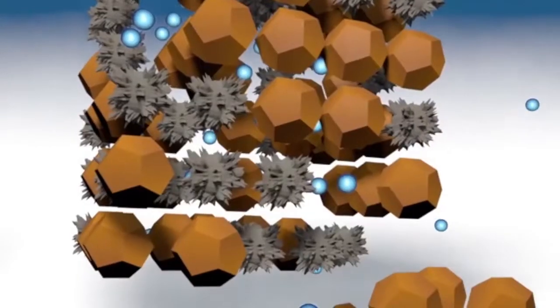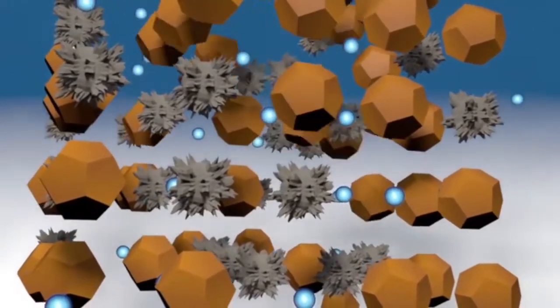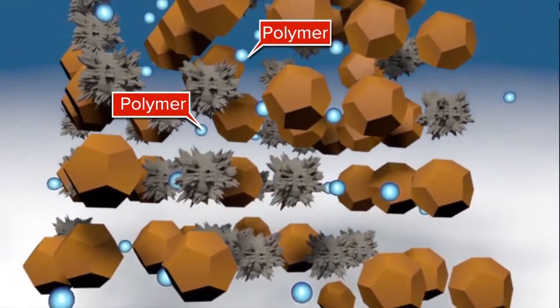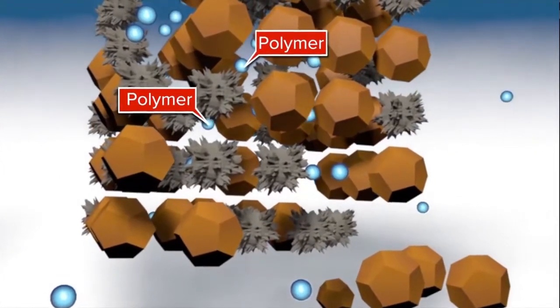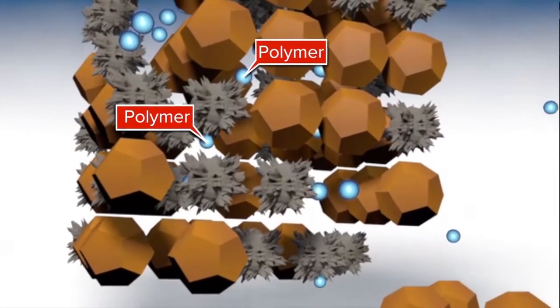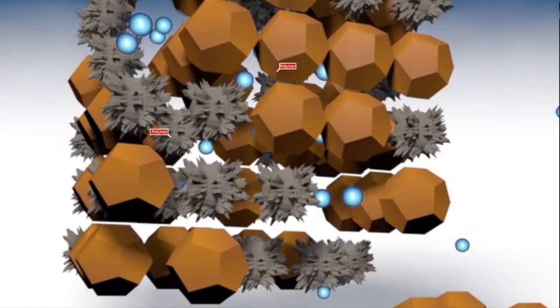So all you really need to get a good bond is cement — is that what we're saying? Cured cement doesn't like movement; it will crack and break. To control that, we add polymer. Polymer gets between these little spikes of cement and cushions them, and when they move, polymer adds some flexibility and creates an adhesive bond. The addition of adhesive components allows the mortar to bond better to dense surfaces, such as porcelain tile, that don't have those nooks and crannies.